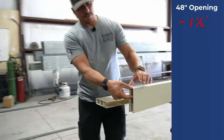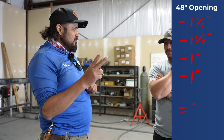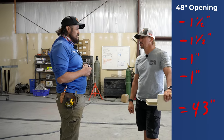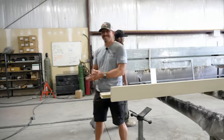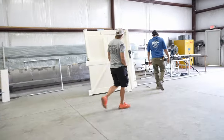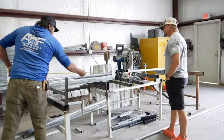You have a pocketed side rail, so that's about an inch and a half on each side. Then we want an inch for the latch and an inch for the hinge, so you take the opening and subtract five inches. Our opening was 48, so the gate is 43 inches. I'm really good at math.